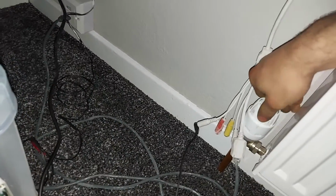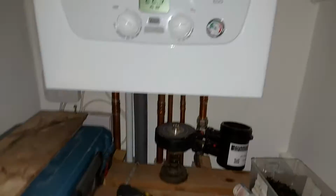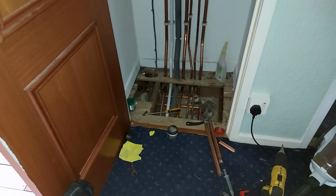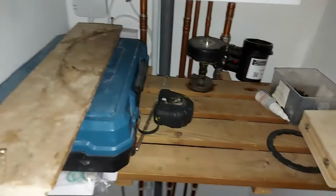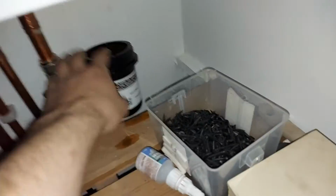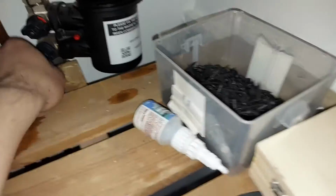No, can't really hear anything. Yeah, that's the pressurised side of the boiler. So we'll probably notice it when I did that. As I keep on doing that, I might drop the pressure, so I'll just continue doing that, and we'll get this bled. All the radiators are now fully open on both sides, so the only thing stopping the water from coming back through into this container is this valve here. So I'm going to very slowly and carefully open it and let the air bleed through the heat exchanger.